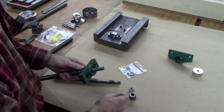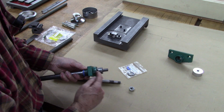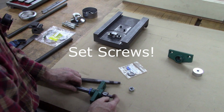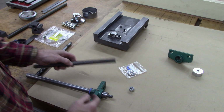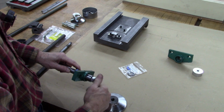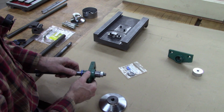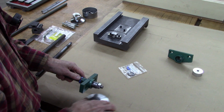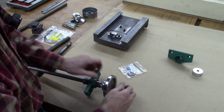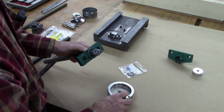Thrust bearings on both sides. And this sleeve right here, it's just a smooth sleeve inside and out. Fits over that. And then there's 2 lock collars that will lock it down to this flat area. And then when I make the new lead screw, I'll make this a lot longer. And this is half 13. That will adjust the clearance on these thrust bearings. Then I'll put this over that, and the shaft will stick out here, and I'll put another nut right there, and then I'll lock them down on the handle. It was keyed. I don't think keying will be necessary, but if it is, I'll cut a key in there.